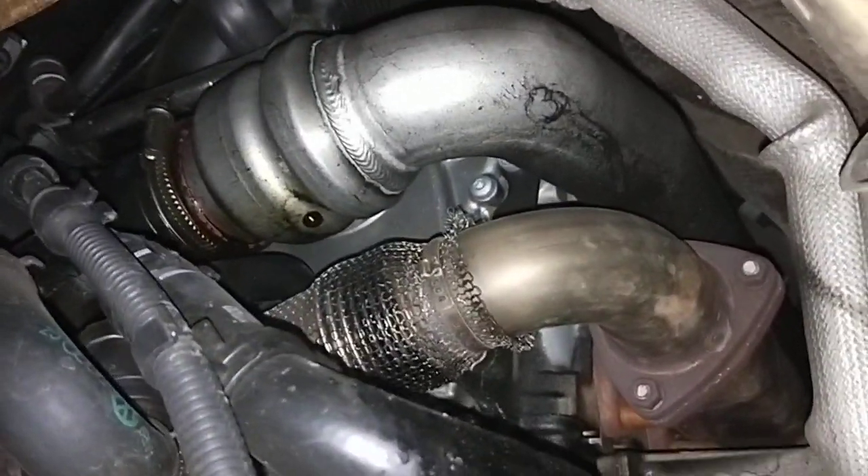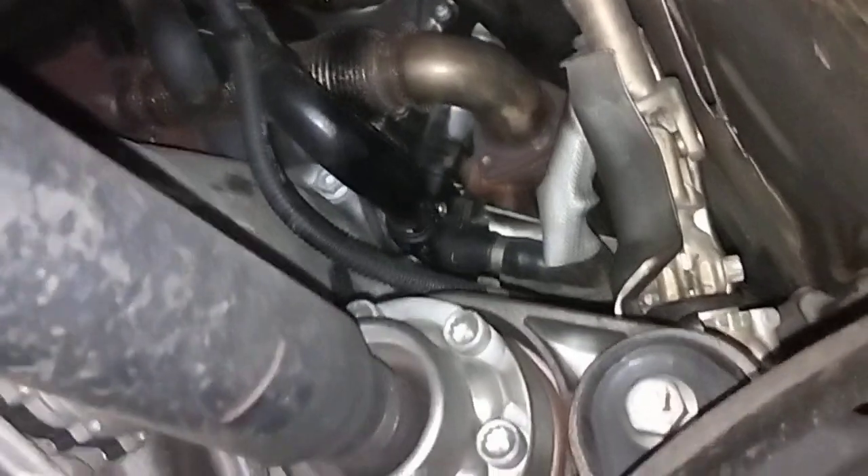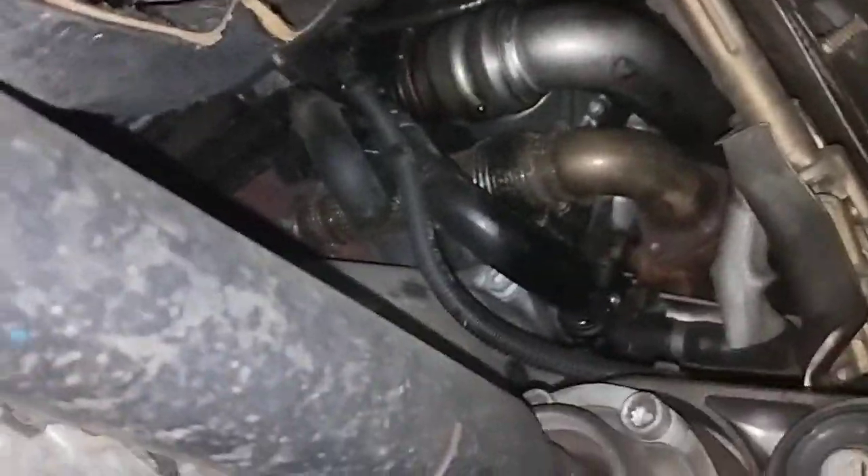If you look carefully in there, there's a bit of oil leaking from the top. It's coming from the actual pulsation damper on the top, coming down and leaking to the bottom. So we have to change that first and then wash it down and go from there.